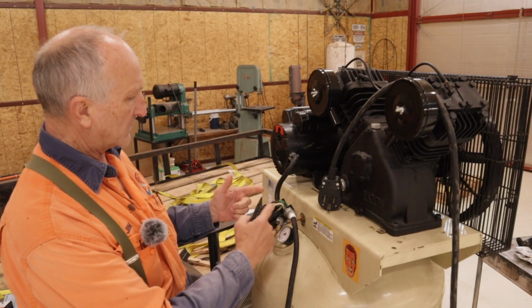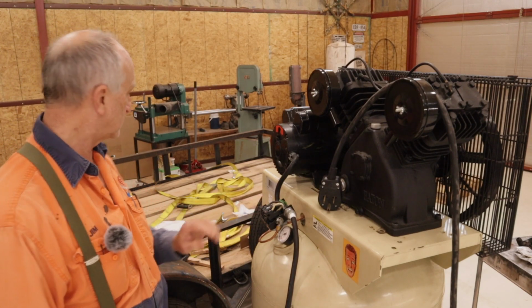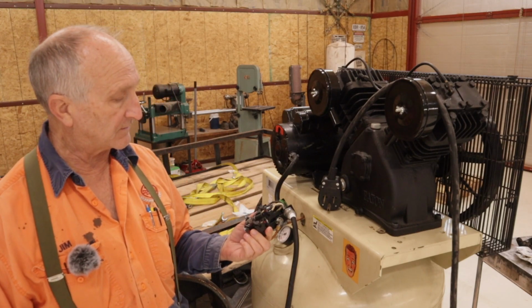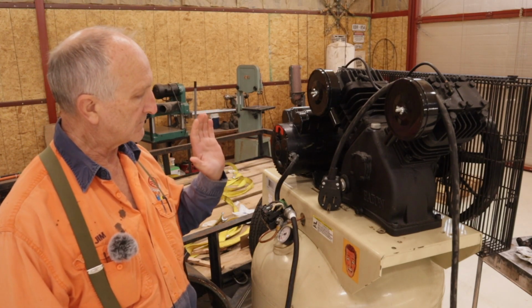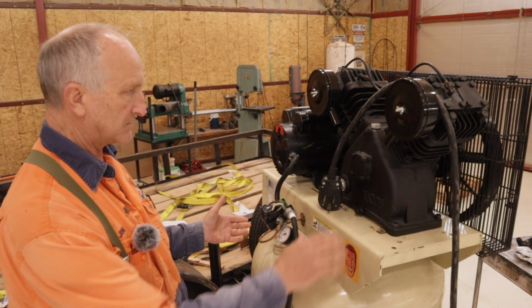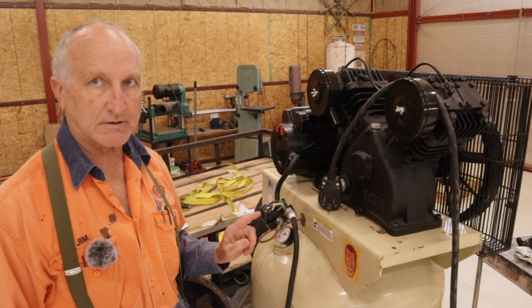And I had to take a screwdriver and pry this one off. That meant this one's welding as well. This contact is doing exactly the same thing, or this little switch. Brand new. It's happening exactly the way that this one did, and this one melted. Okay, Ingersoll Rand switch. Ingersoll Rand equipment. That's now an Eaton pump. This is all shipped as it was from the factory. That's why it didn't shut off.